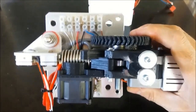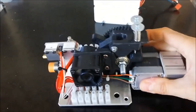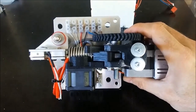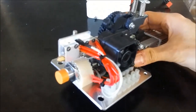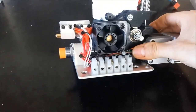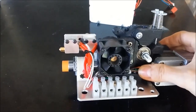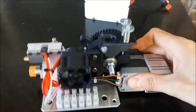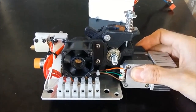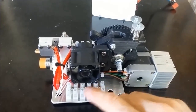This plate is an adapted standard plate that'll mount on my 3D printer. I'll be able to mount a double extruder setup later, so this is just a trial to see how it works. There's an 8mm proximity sensor sitting about 5 or 6mm above the nozzle depth. There's also a nice big fan — we'll run it at 5 volts, otherwise it runs far too hard. It's actually out of a 1U server. All the connector blocks are here for connecting the motor and heater.